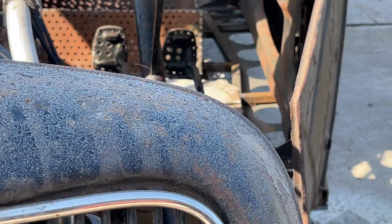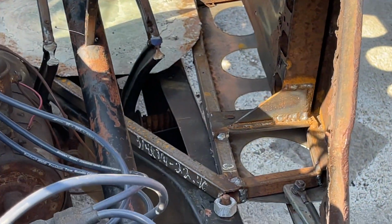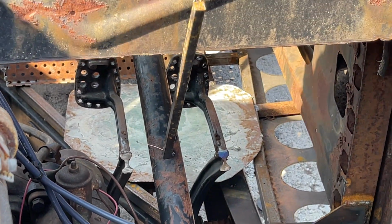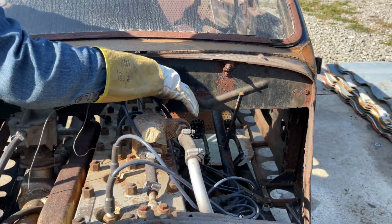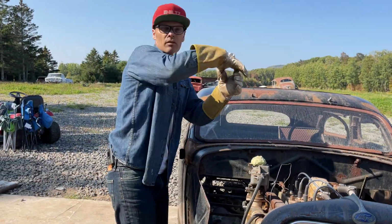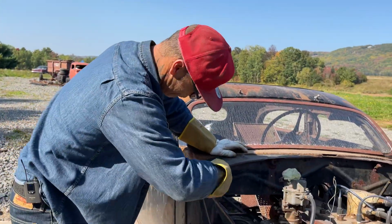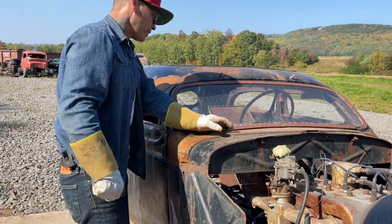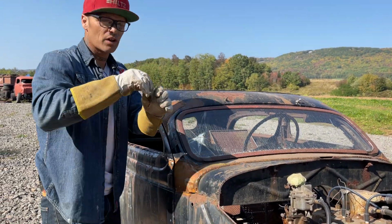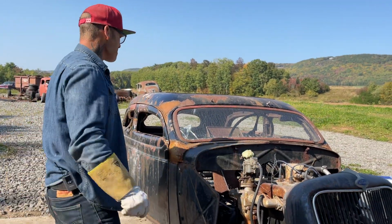We'll finish our sheet metal for our wheel well down to the square tubing in the back so everything's nice and strong. We still got to put a piece of square tubing from the A pillar to that A pillar, and we're going to put it underneath the steering column. We'll drill two holes in it, and that's where we can U-bolt our steering column in place. That's pretty basic. Just jump in there and cut it, get it the right length, get your two holes. I'll plasma cut them real quick. U-bolt it.